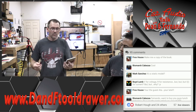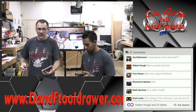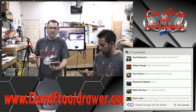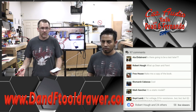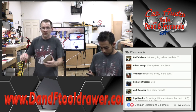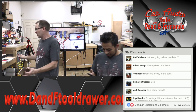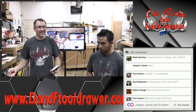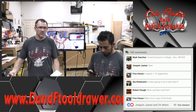It's consuming 292 watts to produce 272 watts. That's telling us this amplifier is pretty dang efficient. If we take 272 divided by 292 that gives us the efficiency of the amplifier in this scenario. That's going to change every time you lower the ohm load — if this was a two-ohm load, all these numbers would change, the amp draw would go up. That's why the ohm load is so important to the equation. At the end of the day, a 30-amp or 25-amp fuse would probably be enough. If it's 21 amps, I'm going to round up to 30, so I need a 30-amp fuse.